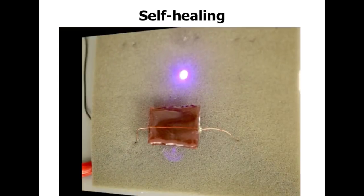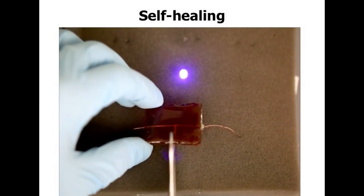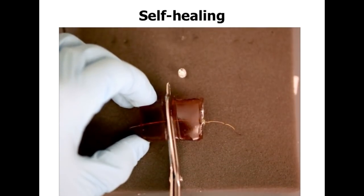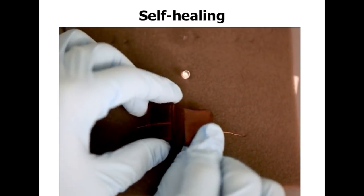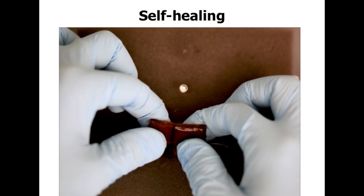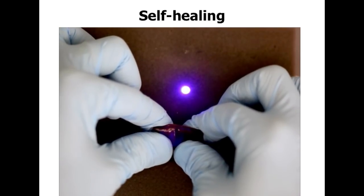In addition to being stretchable, one of the other interesting things this material allows you to do is make self-healing circuits. Here we took a simple circuit — a battery connected to an LED through a wire made out of liquid metal — and we come in with scissors and cut this thing entirely in half. We mechanically break it and, of course, electrically break it as well. You may notice that the metal did not squirt out, nor did it withdraw into the tubes. The point is that it oxidizes so fast that it's flush with that interface, such that when you contact the interfaces, the light comes back on. We've now electrically healed it.